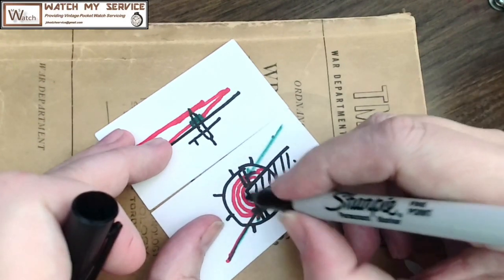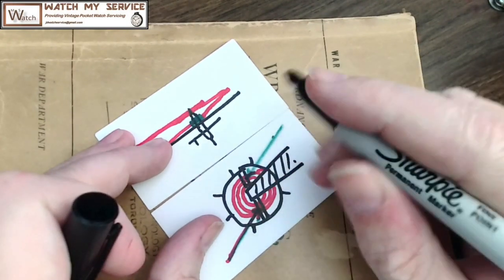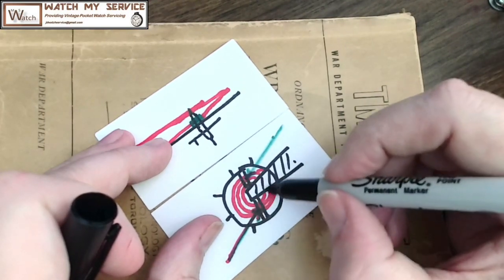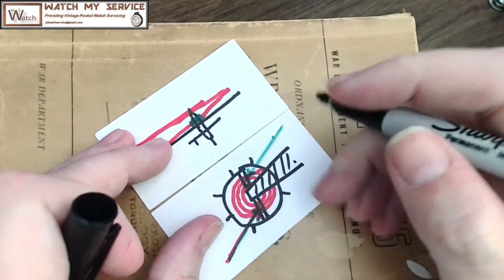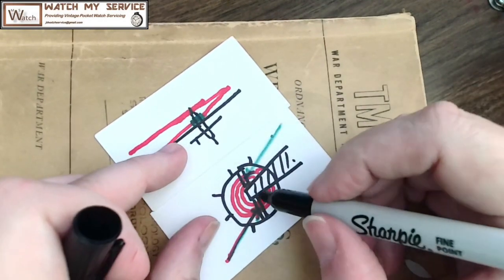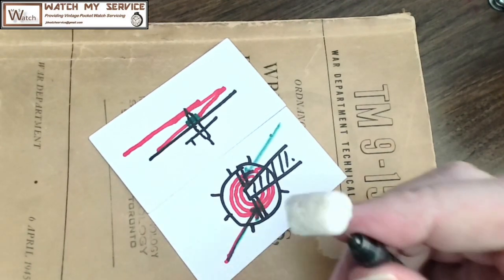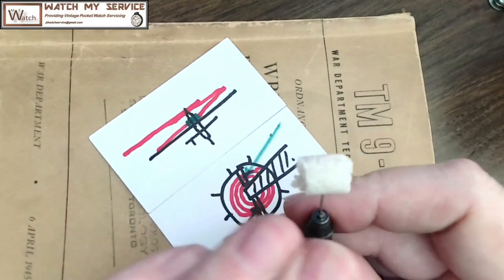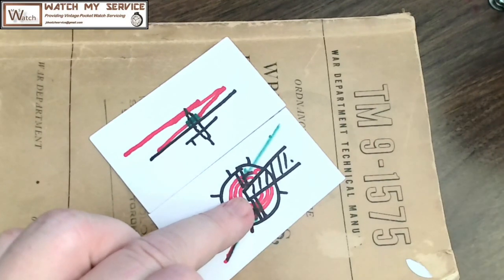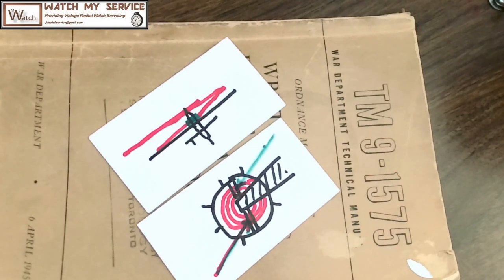You can take the whole balance complete off the balance bridge, and then adjust the hairspring on the collet with it on the balance. You can do that and make sure it's flat all the way around, and then reinstall it. Or you can take the hairspring completely off. There's devices you can put it on, but you can ride the hairspring on the needle like this, and then adjust that so it's flat, and then take the collet and restake it onto the balance staff, and that'll fix that problem. The other thing that I had the other day was just a bit different.